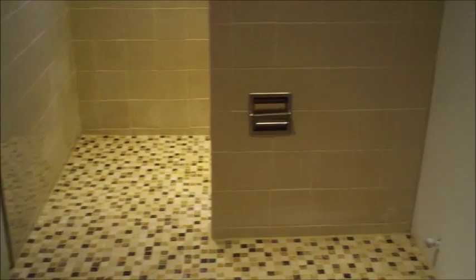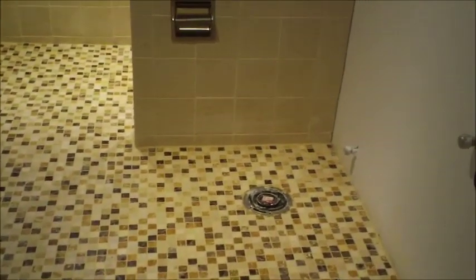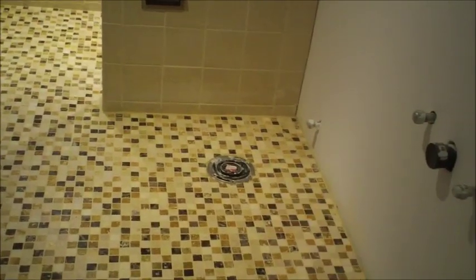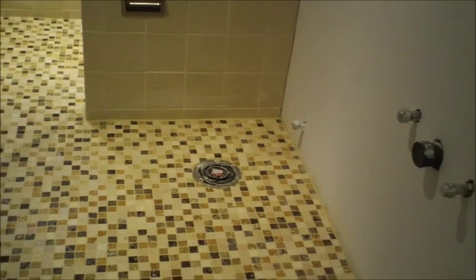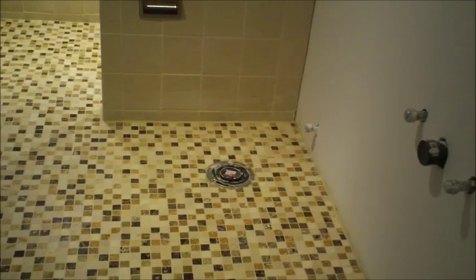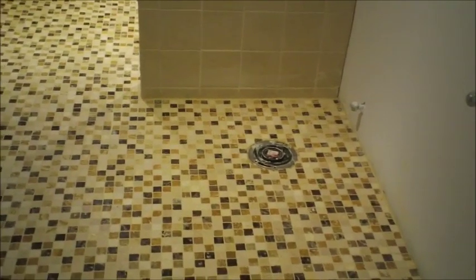I have a spray bottle — I'm going to put the sealer on, clean up a few more tiles in the morning in the shower area, then seal her up. She should be good to go — seal the floor too. I've got the plumber's putty and everything we need. I've got to crawl under the house to set the toilet flange, use the ABS cement, remove that again from the floor, cement it, and push it in. I'm going to be below pushing on the pipe upward while Jen rocks it back and forth so we get a good seal. We'll talk about how to properly set the flange with the location for the closet bolts — the two bolts that hold the toilet down. The whole project is getting fun now because stuff is coming into a finished position. Thanks for being here today; the excitement builds as we get closer to wrapping up the CASA bathroom renovation project.